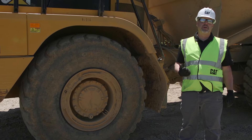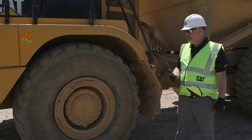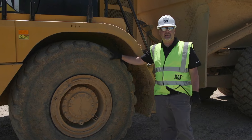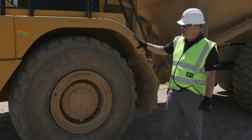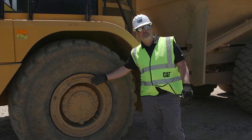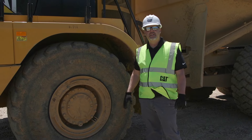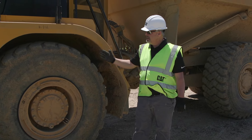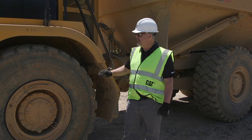A couple things with tires that we always want to be aware of: tire explosions. I want to make sure that I know for a fact that this tire isn't hot and I've got to worry about it exploding. Because if it were to explode and I was standing in front, this lock ring would blow out — and this lock ring can projectile out 1,500 feet in a tire explosion. So until I know for sure that this tire is safe, I always want to approach this tire at a 45-degree angle so I'm not in front of that lock ring.